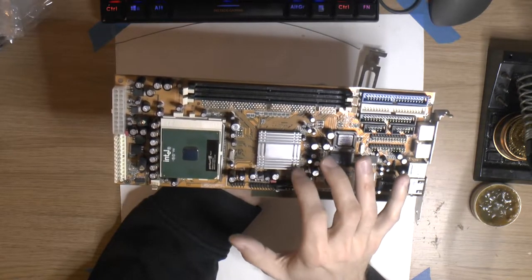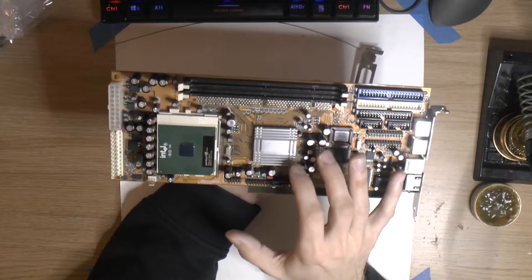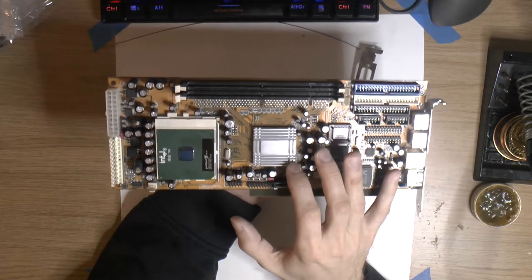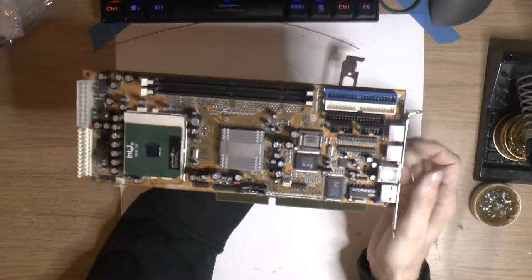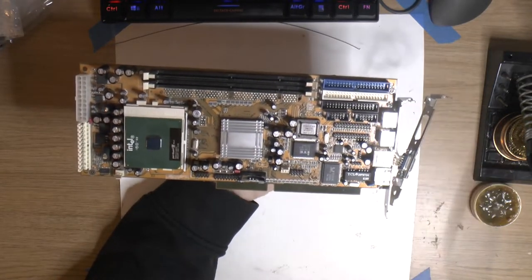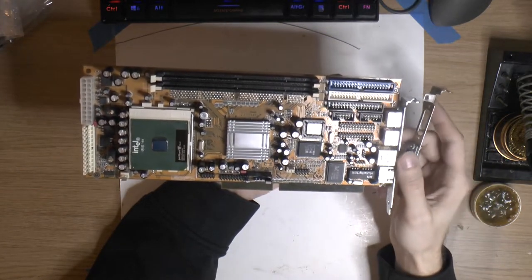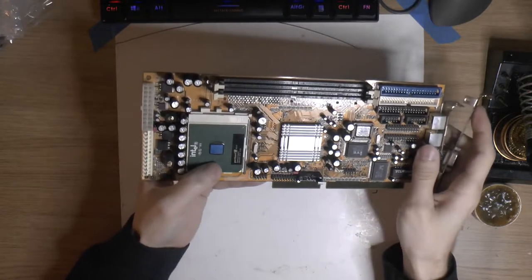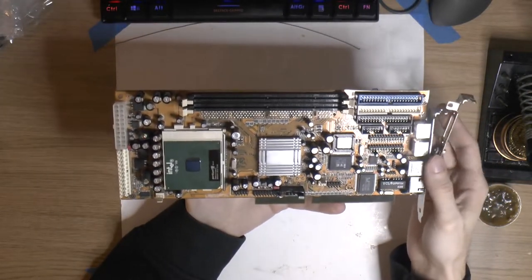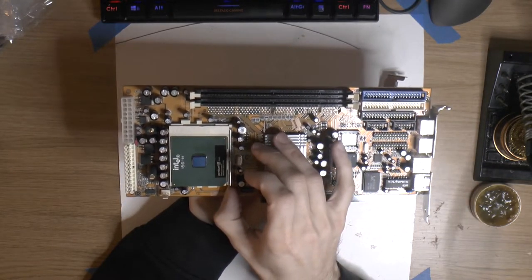I don't think this one supports dedicated VRAM. The 630 is supposed to do that. This is the E version. I don't think it has any support for that. It was rarely used apparently, so I think they removed that on the later revisions. So it uses RAM for VRAM. And it supports Celerons and Pentium 3 socket 370. I'm not sure about Tualatins. My friend said it supports it, but there's nothing in the manual about it.